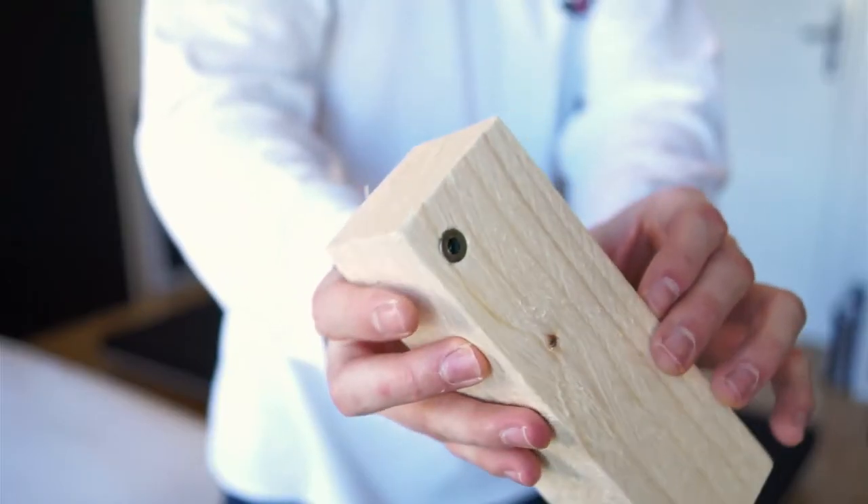Basically the last time I assembled it, I just put timber screws straight into the wood. But now because I want to make it possible to disassemble, I'm putting in threaded inserts. This means I need to put the panels in place, drill some holes for the inserts, take the panel off, screw the inserts in, and then put the panel back on and put a bolt in. It's a bit of work, but hopefully once it's done it's the last time I need to assemble it — unless I need to take the top back off for more wiring.